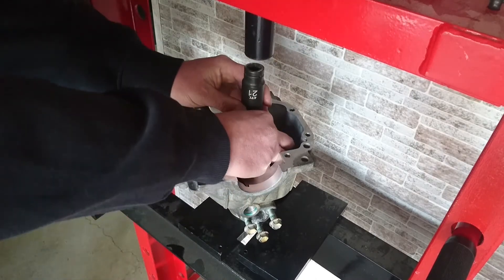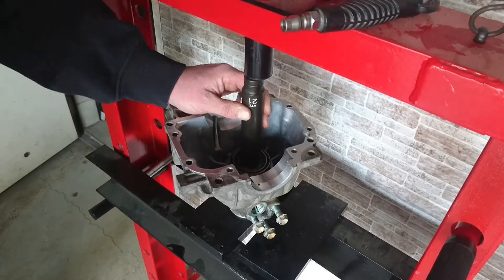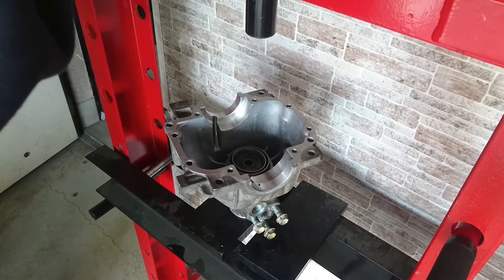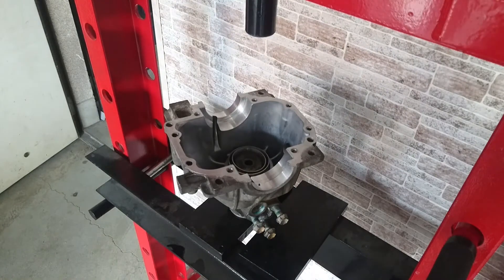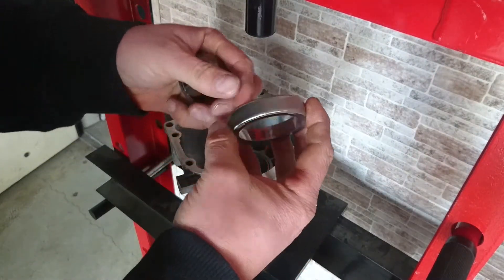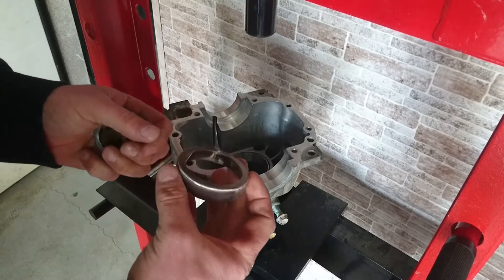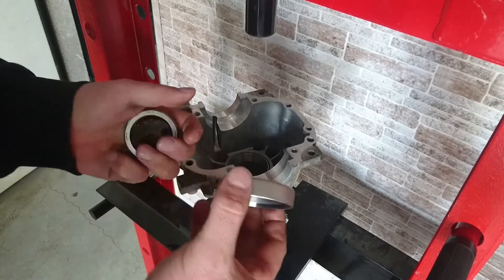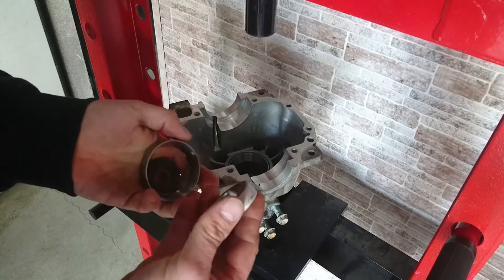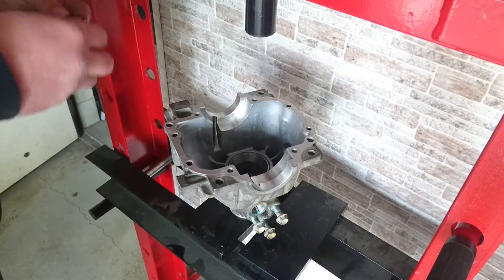This one I could just press in with a plate if I had one. Looks to be very in. Okay, so - old race shaved down, fits on there so that it pushes just on the outside of the race I want to install but doesn't touch the housing. That worked well, so I'll hang on to these and now I have the equipment for next time. I hope there is no next time because that was a pain. And just a washer.